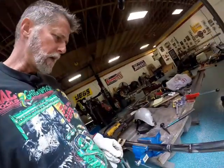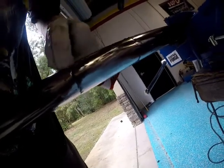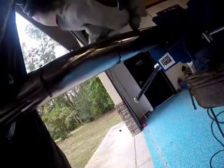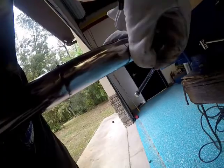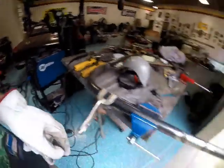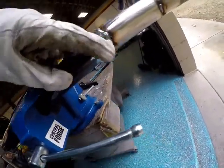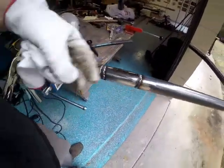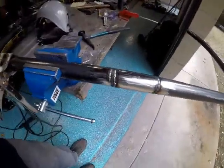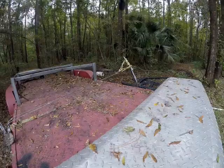I'm back. Okay, what I'm doing now, and I'm gonna show you, the weld being a little hot, I got a little, and this bar, the piece that I put in was probably a little bit tapered, but anyway, it gives me those little craters along the edge. And I'm going to fill that stuff in. By doing that, I turn my heat down some, so I get a little better buildup. Then I just go along and buzz on top of those and grind it some more, and it'll be like one smooth piece of metal. So I'm gonna do that and get right back to you.